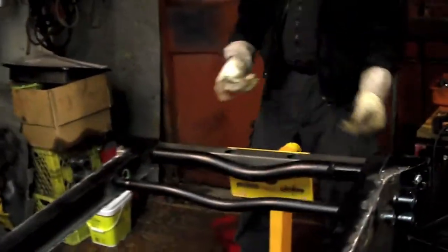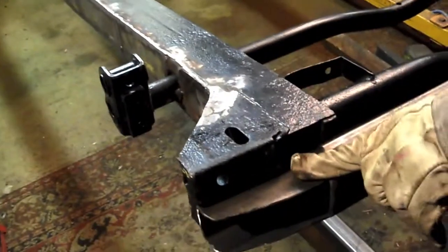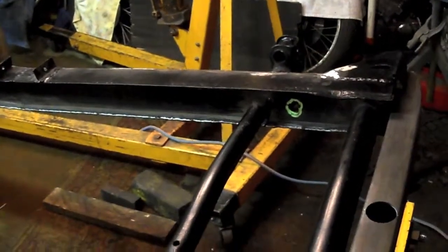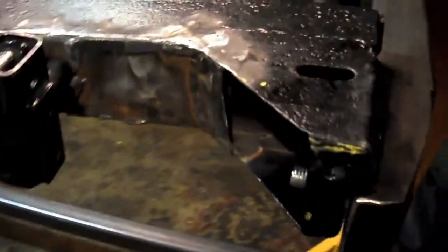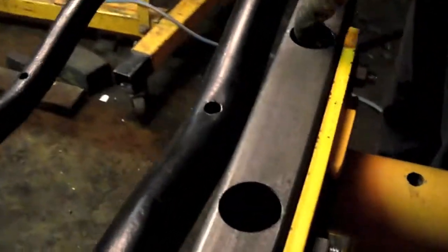Down at this end, I took a piece of the 2x2 steel tubing, chopped off a length, and bolted it to the frame. First I had to grind off about a quarter of an inch of protruding flange — the dreaded protruding flange was about to interfere with my plans. I bolted it to a convenient bit of frame that was actually designed to be vertical, and bolted this massive structure to the engine mounting plate on the engine stand. I accessed this by drilling bloody great holes in the tubing.